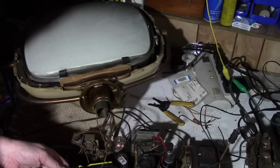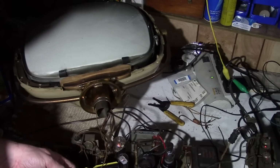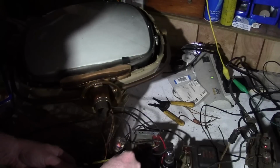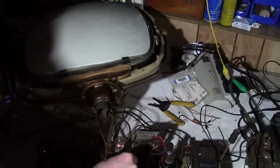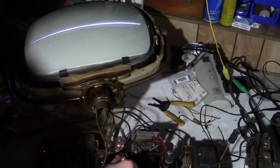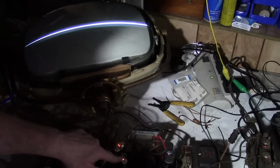Kind of found a sweet spot for the damper, I think. Yeah, if I kind of keep it there and sideways pressure on it. Oop, not anymore. Alright, fine. I'll just keep my finger next to the flyback. If that's what it's going to take, I'll make the sacrifice. Still no vertical deflection now. I'm going to cut the brightness down.